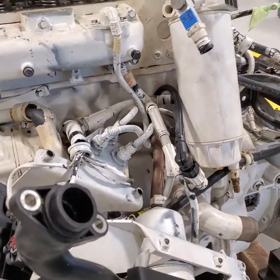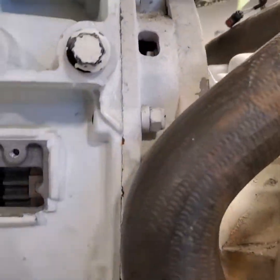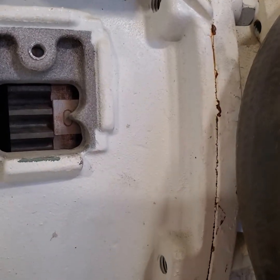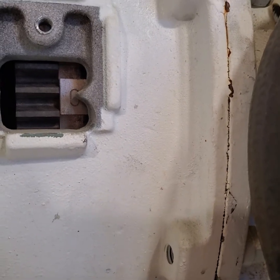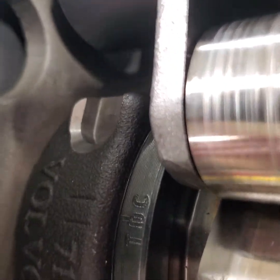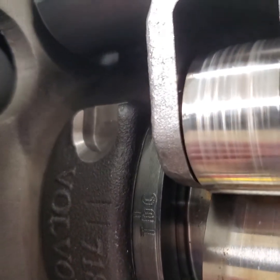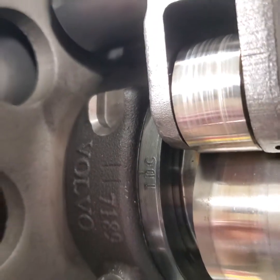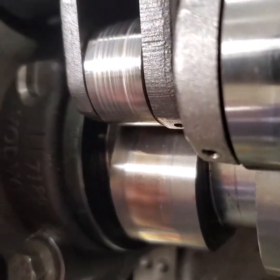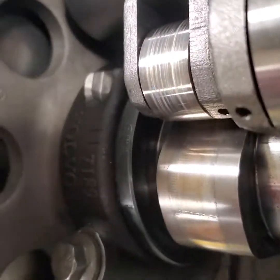I need to bar the engine over to bring the timing mark up between these two lines. Now let's look at our timing mark. I have something new in the window and that looks like a zero. I'm pretty close to the middle of the zero. I can now see that top dead center line, and it is really close to the center of that mark.